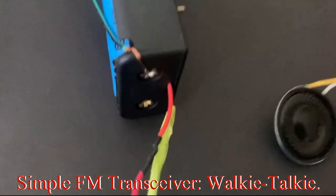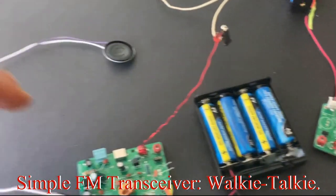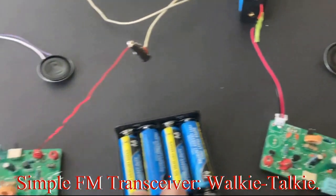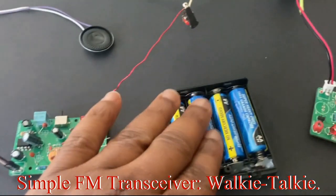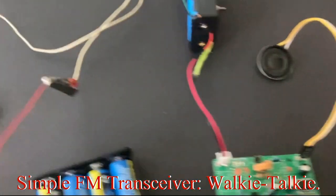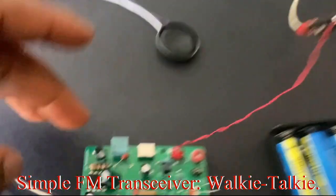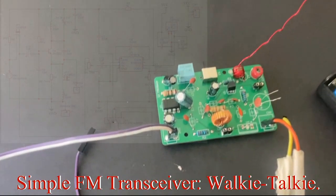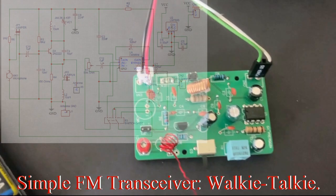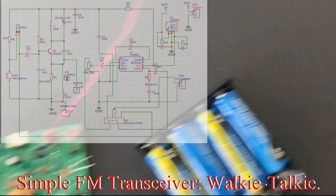You can hear it's talking — volume is low. Before going any further, I just want to show you the duplication we have here. This transceiver is powered by these batteries and this transceiver is powered by that battery. This one is configured as the receiver — you can see the switch away from the volume control. This one is configured as the transmitter, with the switch closer to the volume control. The transmitter feeds the signal into the receiver.